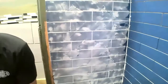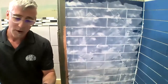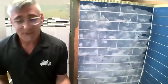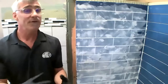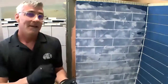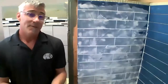William, we have a question on the WA. Is it only a grout? That's a really good question. So Mark mentioned in the presentation portion that ARDEX WA can also be used as an adhesive in a difficult to bond to situation. So his example was to stick tiles in, like, say, an elevator where they typically have a metal floor. So that's a challenging installation there, and ARDEX WA can be used there.